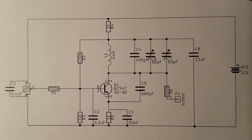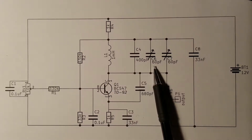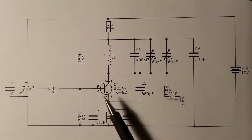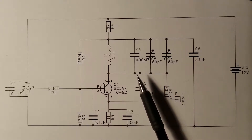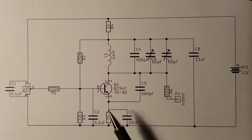There is a resonator tank, made up by L1, C4, C6, and C7, that resonates at the frequency we need. There is a transistor that works as an amplifier to restore the energy lost by the resonator tank due to its parasitic resistances, especially the one on the inductor. Basically, the transistor will inject new energy in the resonator tank at every half cycle, allowing the resonator to sustain the oscillation indefinitely.